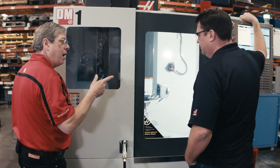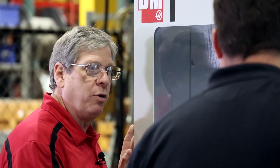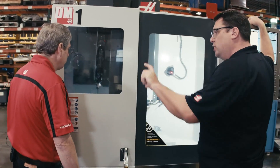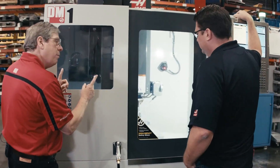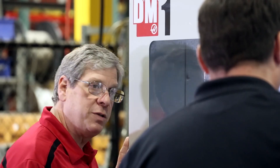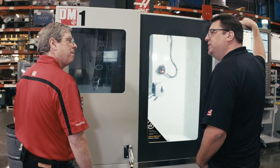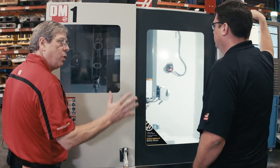That's especially nice if you have an operation that just takes a few seconds — like cutting a really shallow hole or a one-operation drill or tap. There's no tipping pocket, so that also shortens the tool change time. The short arm tool changer arm decreases the time of the tool change because it rotates much faster. This machine holds 18 plus one in the spindle, for a total of 19 tools.